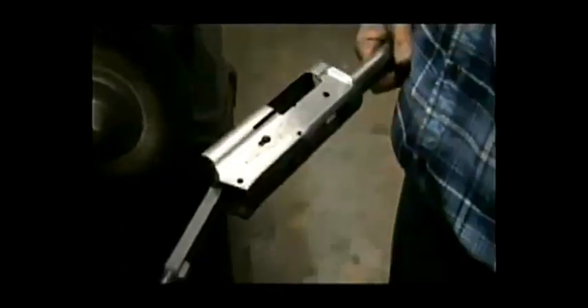We've buffed this receiver on our Tampico brush wheel. It's giving the receiver a nice satiny sheen. What I'm trying to do is get this thing totally ready to throw in a bluing tank, because all those tanks do is turn it black. The type of polish you put on the metal is the way it's going to look when it comes right out of that tank. If I wanted to buff this on a rag wheel and make it as shiny as a mirror, that's the way it would look. But we want this to look factory, and it has a nice satiny sheen to it now.